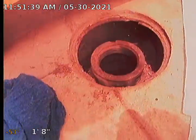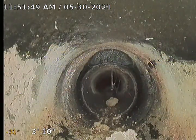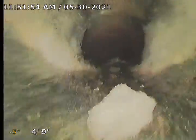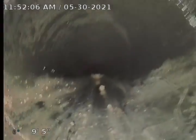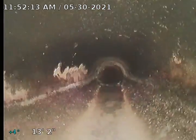Looking at the sewer line vent clean-out on the rear — about a two-and-a-half to three inch pipe going into the rear. There are a little visible rocks and construction debris but it's fine. Let's see if I can push past this. The goal is to get to the main city connection. There's a little dump here, maybe for the kitchen or some other areas of the property. This is three inch ABS right now.